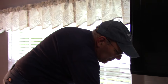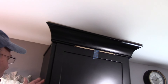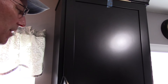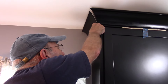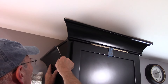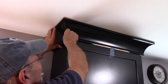We're going to take our side piece now and put it on the cabinet here. I just want to point this out to you: when you have a cabinet, sometimes you'll wind up with a little bit of a lip — this has about a quarter-inch lip on here. And when you put your crown molding up on here, you see how there's a little bit of a space underneath? If you nail on your crown molding and there's not a piece of wood on there, it's going to pull the crown molding in and it's going to open up this joint right up here.